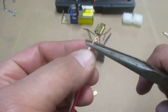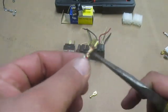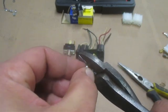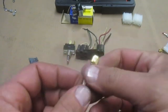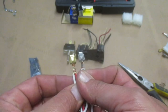These take a little bit more work — you're going to have to work these tabs. You want to try to get it down in there as far as it'll go. Bend over your first side, bend over the second, give them a little squeeze together, and then your crimp. Now it may not look like this, but it's a solid connection.